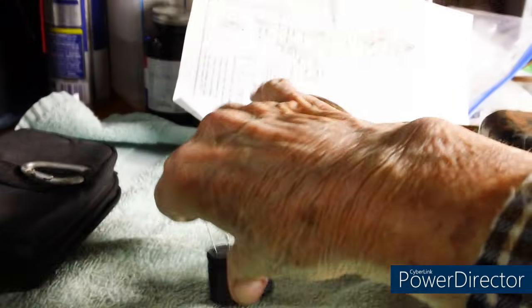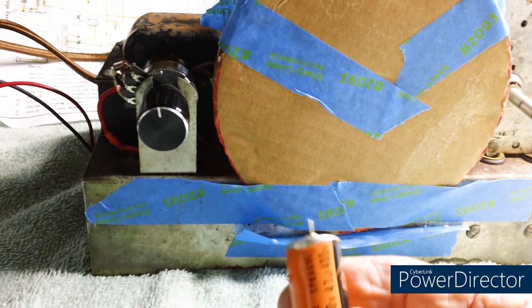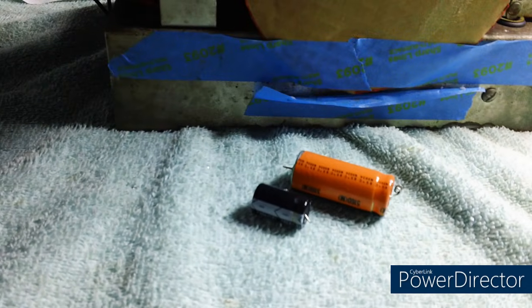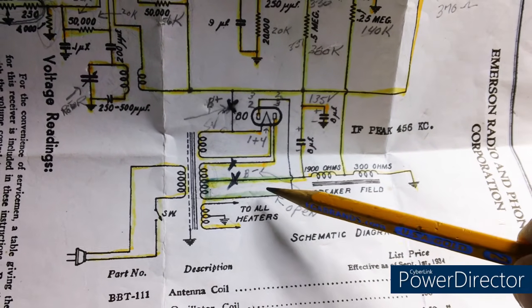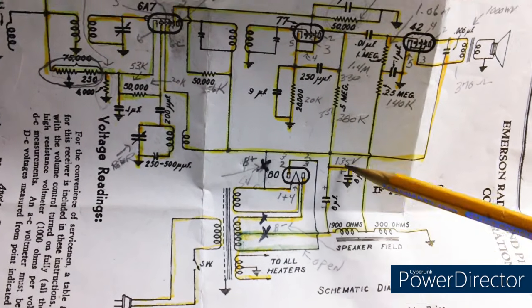But we've got some very high voltage here, and every time I turned it on, it would damage the capacitive layer inside each of the capacitors, because there was only 2 in there. I had these 2 last, okay? These 2 plus these 2 here, these 2 right here on the schematic are these 2 right here. This one and this one, okay? Comes off one leg of this voltage doubler, goes in, goes up, and right there. So those are the ones that are blowing.